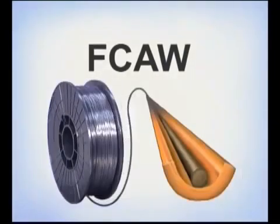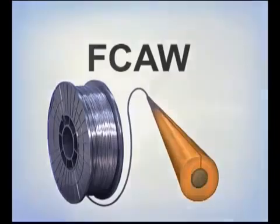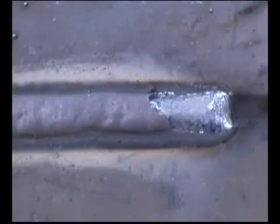This process uses a continuous tubular wire that surrounds an inner core of flux. Compounds added to this flux determine the characteristics of the arc and weld buildup. During the weld, these compounds clean oxides from the surface of the metal, helping the molten puddle to flow out. They also lift oxygen, nitrogen, and other impurities from the molten filler metal, producing a clean weld deposit. As the molten flux cools, it forms a protective slag covering over the hot weld bead.